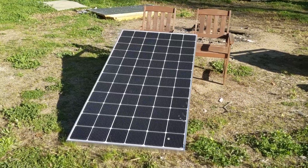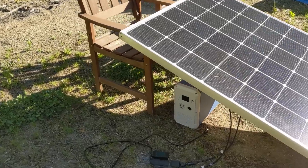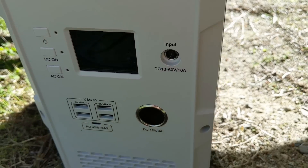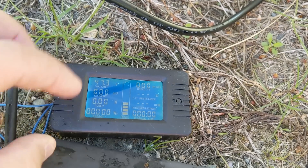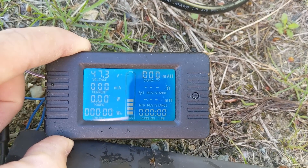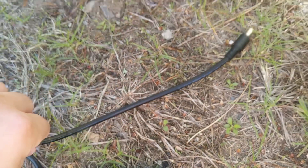Here's the test rig. This is a 365 watt panel just leaning up on some lawn chairs right now. Under here is the Bluetti. Everything is off — it's completely dead. And here's the meter, and I zeroed everything out. So you can see zero watt-hours, zero amp-hours, and zero time. So this is ready to go. Right now it's showing 47.2 volts — that's open circuit because we're not plugged in yet.